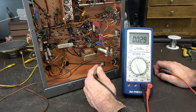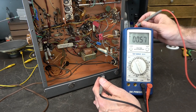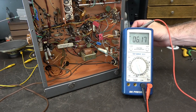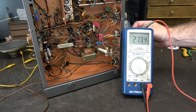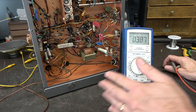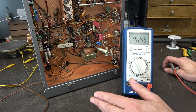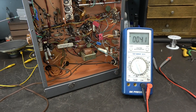There's that cap — I cut the lead loose. Repeating our test: one probe to that control, the other to the plug strip ground. Now we're at around 31 volts. That's still not acceptable — you're still going to get a poke. Cutting the cap loose will reduce the voltage but it's not the best solution. The best solution is to install a grounded power cord.